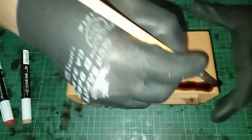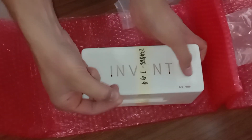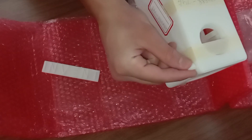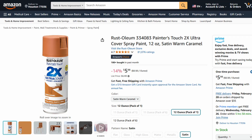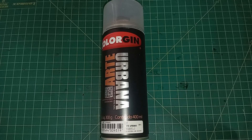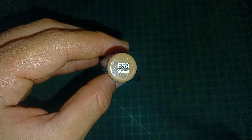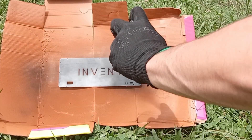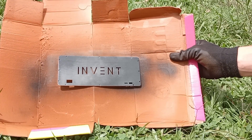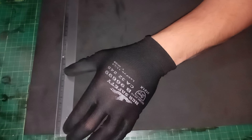Let's move on to designing and finishing the enclosure. Here are the 3D printed pieces. The fit was pretty good, but the plain white finish wasn't visually appealing, so we are going to paint them. To achieve this wooden look finish, spray the enclosure with caramel-colored spray paint. If you are in the U.S., Rust-Oleum Warm Caramel is a great option; outside the U.S., find a similar shade. Once the paint dries, use Copic ink refills E57, E59 and E07 and a brush to create a wood grain texture the same way I'm doing in this clip. Finally, paint the back panel black or print it from black filament. After painting everything, line the inside of the enclosure with 2mm EVA foam sheets to reduce vibrations and improve sound quality.